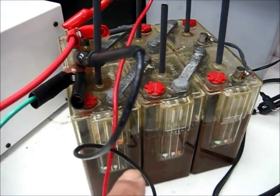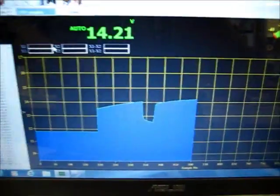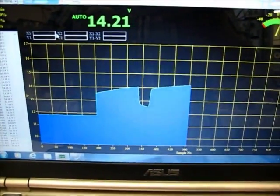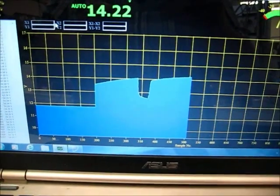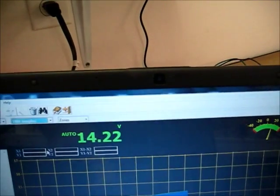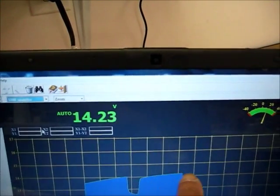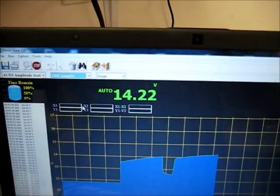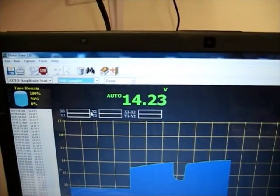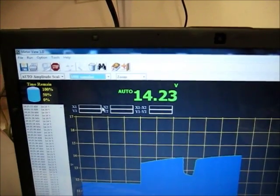It's just going to put it to the battery until it reaches its 15 volt level. Now this is a big battery, so this is going to take some time with the 1 amp panel. I want you to see the curve of how it's doing this. What's happening is that this is raising up and the tracker is starting to track the charge curve. I don't know how high I can push it within the 1 amp panel, but we're going to find out.